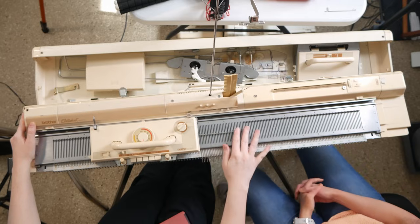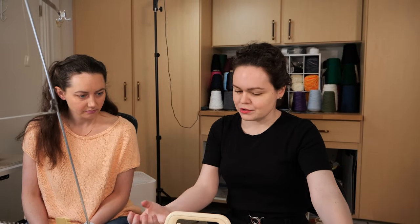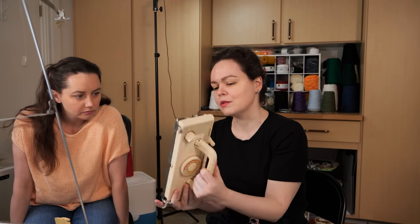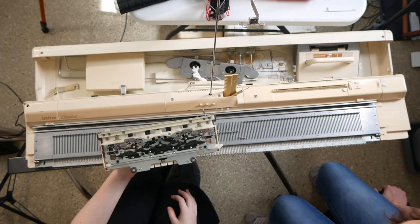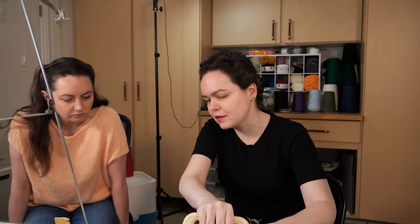And it moved everybody to upper working position because it doesn't have a pattern loaded, and that's just the default state. But the thing that's actually doing the patterning is a bunch of little nubbies underneath that move around, and they force the needles through a different part of the carriage. I think it's over here, and that forces them forward to upper working position. A friend of mine has a really good video explaining how it works. I'll send it to you, and I'll link it in the description.